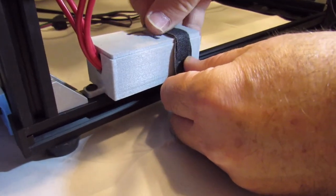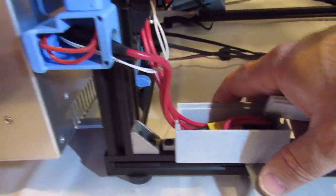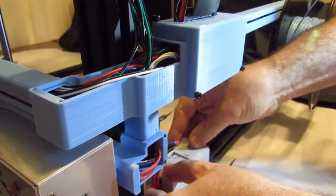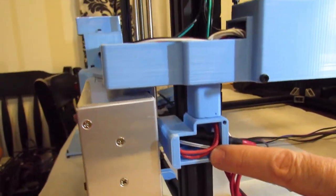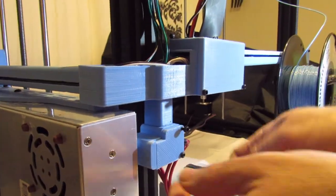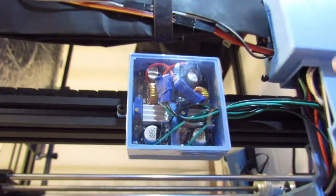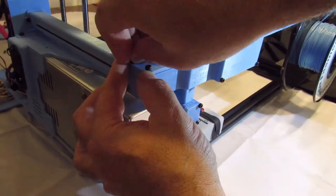Next there's this little box at the bottom — I printed out a bunch of these. They're just little boxes to put any excess cable in to get stuff out of the way. Since I made the channel on the left too small to hold the excess cable for the heater wire, I just threw this in as a place to hide it — it's not really needed but it's useful. The heat bed heater wires go into that channel connection box. Also going through there are the heater cable for the hot end and the thermistor wires for both. So the hot end wires come down through that small riser into this box and then go forward, with a simple little cover that tabs into place and screws in with a couple of M3 bolts.